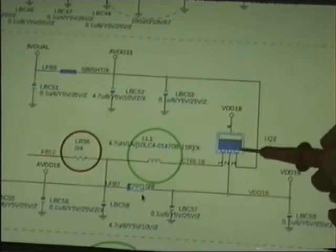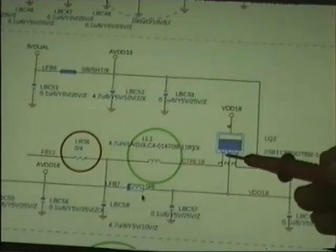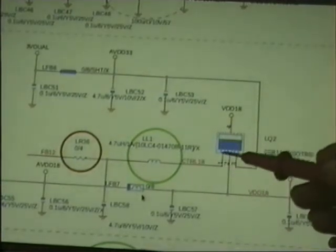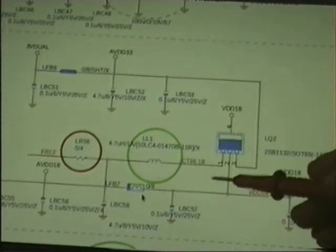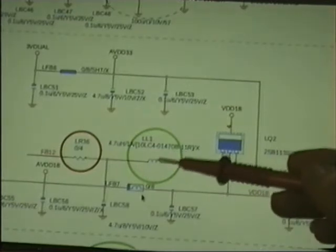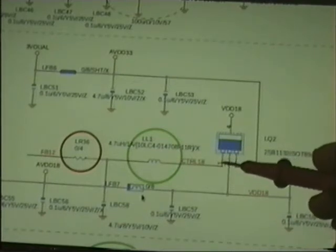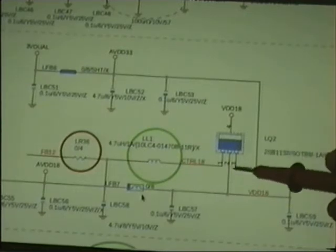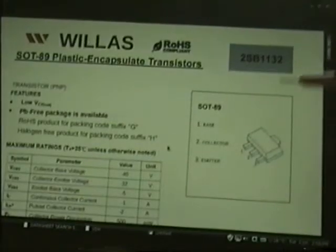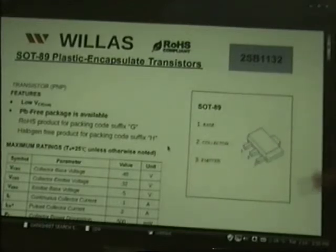I think there's a bit of a leak through the transistor, actually between the collector and the emitter there possibly. Pin 1 — that's the base — and there doesn't appear to be any drive to that. That inductor is missing from the design; they've omitted it. And it doesn't appear to go anywhere, this pin 1 — it just appears to be floating. So naturally you couldn't just leave it floating because this wouldn't work. The datasheet for the transistor — 2SB1132 — it's a PNP transistor.